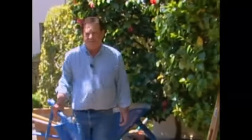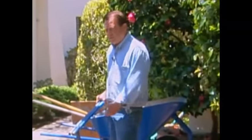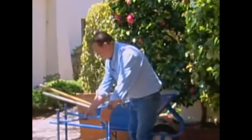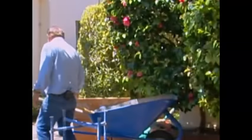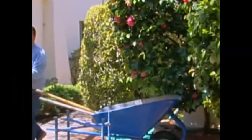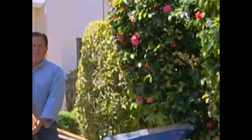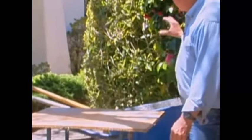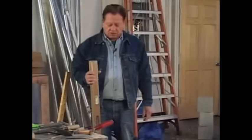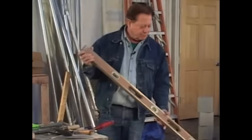is your mortar stand. And this right here is what's going to hold the mortar on the board. So you put it out like so. You get yourself a piece of 1/2 inch or 5/8 plywood. It can even be 3/4, and at least 2 foot square. And this is what it'll look like. Put it on top of that. This is what you're going to take your mortar out of the wheelbarrow and put on here.